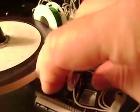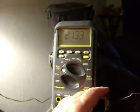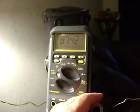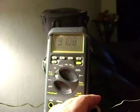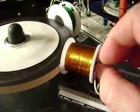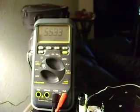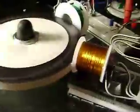If we put the iron core back in, she's up to two volts. Bring the reed switch back in — 91 volts. That's amazing. You can hear the wheel dragging down. As I pull this core back out, you can see the voltage drop. I thought that was a neat conversion — just having the reed switch short out that little bit of voltage across the coil and getting these high voltages.